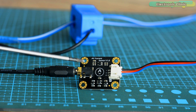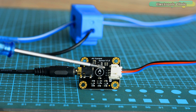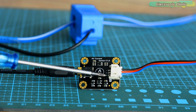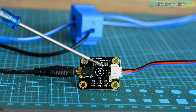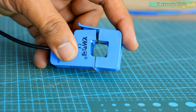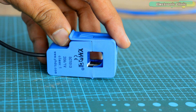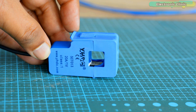The AC current signal conversion module has an input voltage range of 3.3V to 5V and comes with a 3-pin interface. The A pin is the analog voltage output (0.2V to 2.8V DC) connected to the analog pin of the controller board. The plus pin connects to 3.3V or 5V, and the minus pin connects to ground. The split core current transformer probe has an AC current range of 0–20 amps, accuracy of ±1%, frequency range of 50 Hz to 1 kHz, and operating temperature of −25°C to +70°C, weighing around 50 grams.